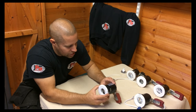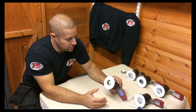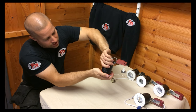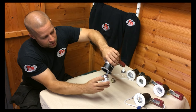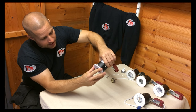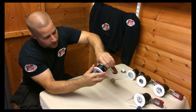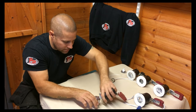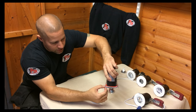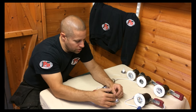This one — these are the type that can catch you out. This will normally be found in a bathroom, above a shower head normally. You may find that you have to pop it out of the ceiling very slightly and all you do is just twist anti-clockwise. Again, you can see the clasp — same two pin lamp holder. And then just to put it back in, twist it clockwise. Anti-clockwise to undo it, clockwise to do it up. One thing you will notice on this one — I've said that these are used in bathrooms — there's a rubber seal all the way along here and a rubber seal that sits along the top there as well, and that's so that it achieves its IP rating. It doesn't let moisture penetrate the unit.